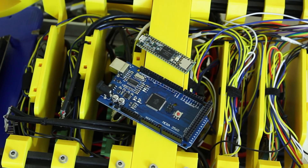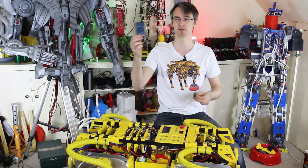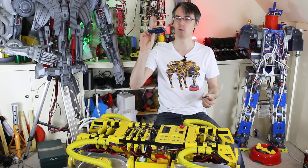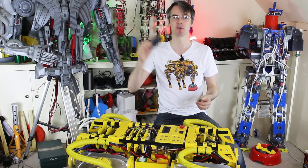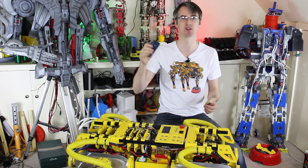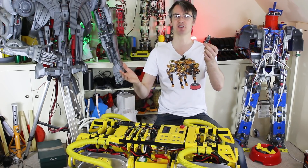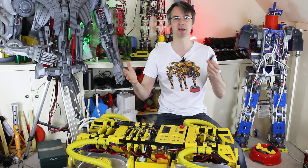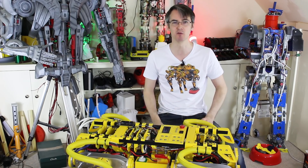So what's stopping me just replacing those three Arduinos with this one Teensy? There's nothing really stopping me restructuring the code and putting it on the Teensy. The Arduino Megas each have four UARTs, so we've got one talking to three ODrives over serial, and a master Mega 2560 talking to the other two. The Teensy 3.6 has six UART serial ports, so I can talk to all the ODrives from one controller — there's nothing actually stopping me replacing it.